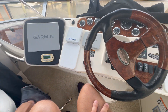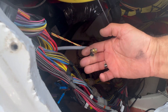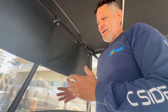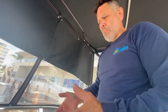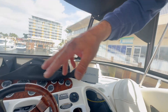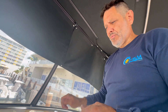This vessel was equipped with throttle position sensors — TPS sensors. This is a 33C cable that goes into a TPS sensor that operates the throttle. We were pushing the TPS sensor to full throttle and retracting it to idle. Double-check these before ordering, because you could order the wrong parts. This is a full electronic control system and it's plug and play. All we did was order the harnesses from Glen Dunning for the correct lengths, made our cover plates, and it's ignition-enabled — when you turn on the ignition, everything works.